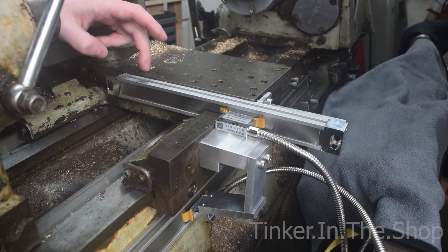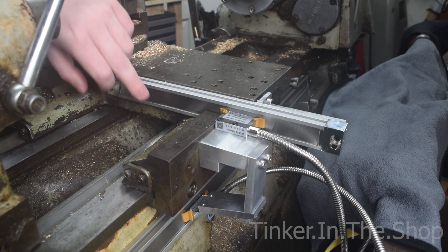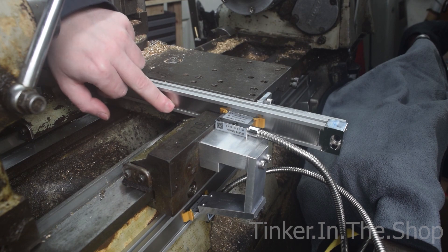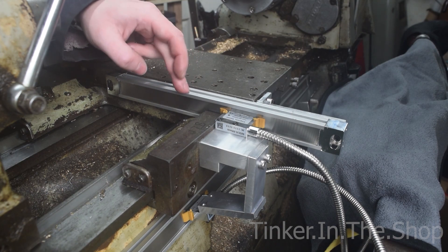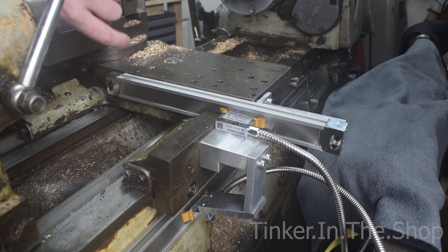It's quite thick on the back, so I could have taken more if needed, just for your reference. The actual strip is behind this stainless protector, so you've got quite a lot of room. If you really did need to mill them down very thin, you would just have to make some custom end caps, because they're what hold it on to the machine.